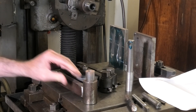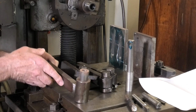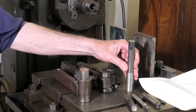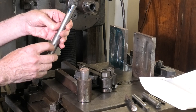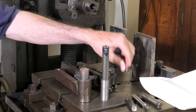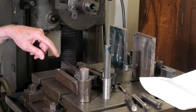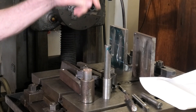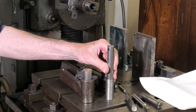Boring bar holder — this is one I made for using in the shaper. Tools are held in by a couple of grub screws. I have made a boring bar but like a lot of things I've made, it's disappeared. But I did make this up for smaller bores, and that hole has been squared up roughly with this squaring tool in the slotting machine. A slip sleeve fits over the outside of the bar and drops into this holder, so you get the rigidity of the holder without a bottom. The tool bottoms out and the hole is not a through hole, and that stops it sliding away as you're working. Tools are quite easy to make.